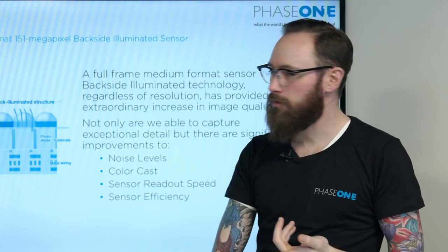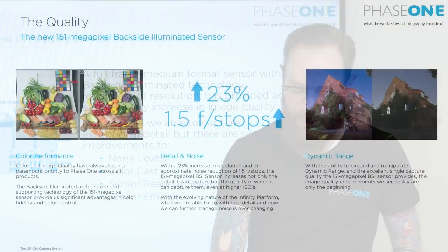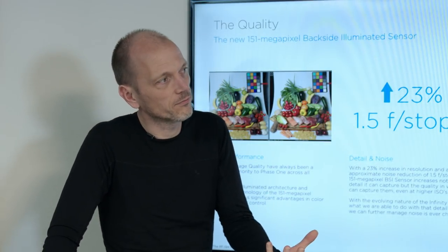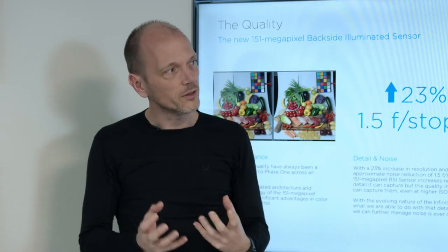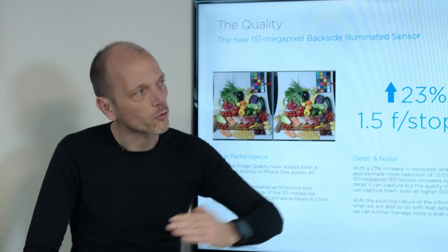So we're getting the best in color, a more efficient pixel, and lower noise. All that translates to: we have the color performance that Phase One deems necessary to claim having the best image quality. We have about a stop and a half in terms of performance improvement — because using all the light means we have to gain up less, causing less noise. But also the new pixel technology, the new manufacturing technology, inherently is less noisy. Combining these two gives about a stop and a half of less noise, all across the ISO range.